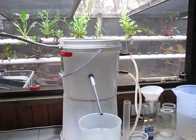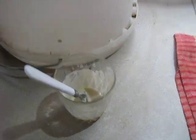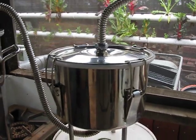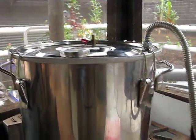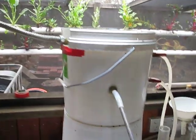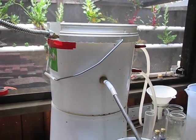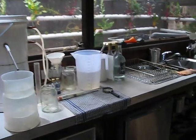So that was the only real biggie. I'm still using the flour paste to seal the lids up. The seals on these - that one's actually doing well, the thumper is doing well, that one I have to use the paste on. I did split the condensation pot by running cold water through it when it was stinking hot, which was a really big mistake.